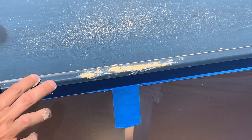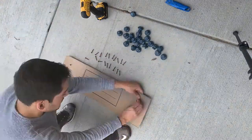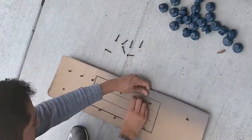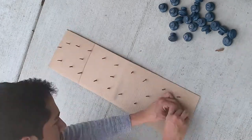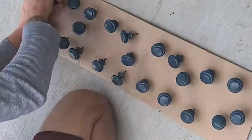Normally I would put wood filler prior to getting everything ready to paint — it slipped off my mind, I'm not perfect. Because the knobs and the dresser tops already matched, I wanted to continue with that theme. So I took the screws from the knobs, pushed them through cardboard, and then put the knobs back on the screws so that when I'm painting I can do it with them hanging upside down.